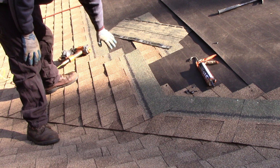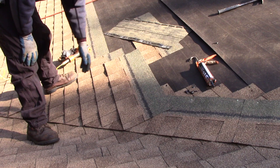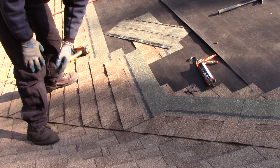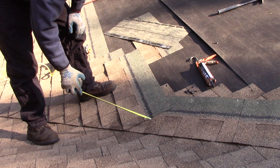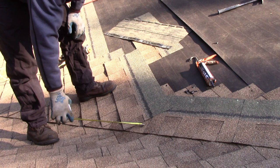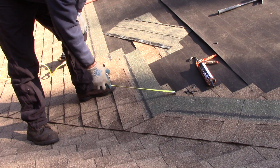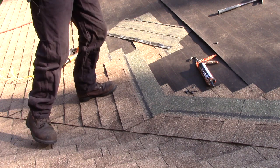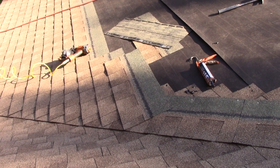I'm not going to nail it yet because I've got to tie it in, but now I'm down where I need to be. When I run the courses that way there's no chance of water traveling up. There's no ice dams on this roof anyway, but water can't travel up. There's a bead of tar — a pretty thick one — under here, so if water tries to go back up the roof it's going to hit that bead. Even if it did penetrate it's not going to go far. So there you have it — pretty easy, simple as pie.